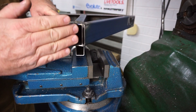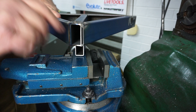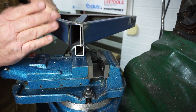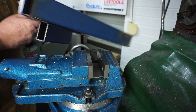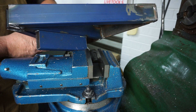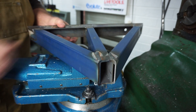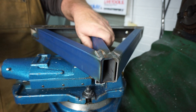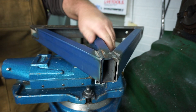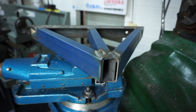I'm a little bit out with my measurement here, and I tried to grind it on the radius of the multi-tool, but to no avail. So I'm going to throw it back in the mill. What I had to do is weld a piece on the bottom just really quickly, and that will allow me to hold it in the vise, and then I'll be able to clock off it, find the centre, and run the boring head back down through here.